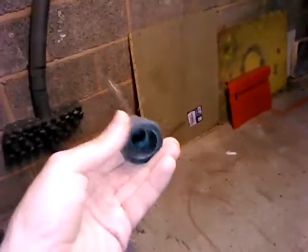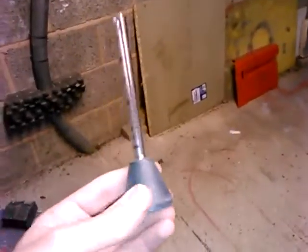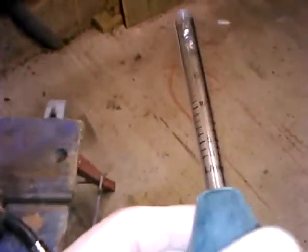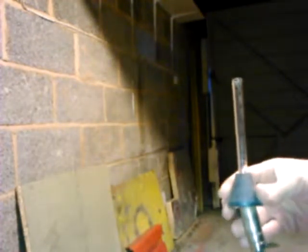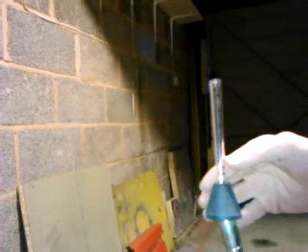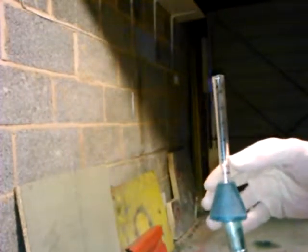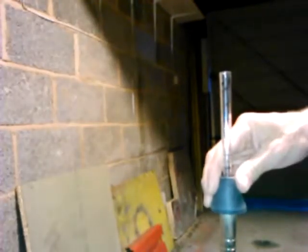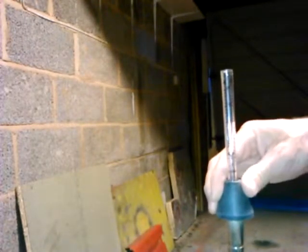The first thing to do is check the flow rate of the gas. We haven't got any gauge on the system here, so we have to use this crude gadget which is a flow measuring device. We put this rubber cone over the end of the nozzle and look at how far this ball bearing goes up in the tube. The instructions say you need about three to five litres per minute; I've discovered it works better with slightly more, like about six, which is where my thumbnail is. So pressing the trigger - that's about six litres per minute.